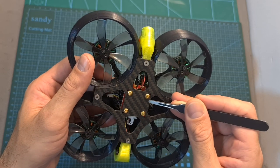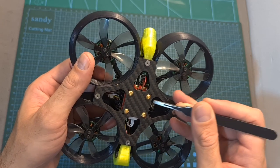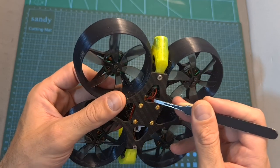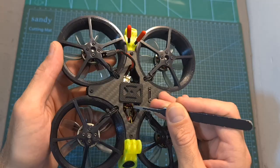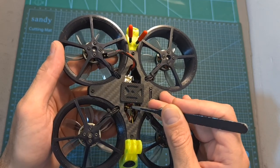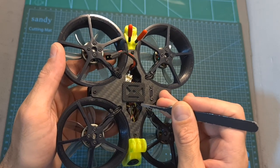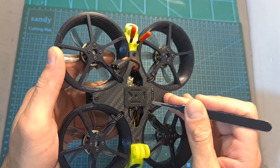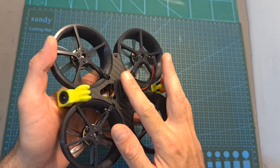On the center of the frame, well protected between the two carbon fiber plates and 3D printed ducts, you can find the HGLRC Zeus F722 20x20mm stack, which is based on a 28A BLHeli_S 4-in-1 ESC and an F7 flight controller. The Zeus Nano VTX is mounted on the top of the stack, and since you can't access the micro USB connector of the flight controller without disassembling the frame, a micro USB to USB Type-C extender is pre-connected to the flight controller and secured to the top plate. In addition, it is using an XT30 battery connector, and the battery is mounted on the top plate.